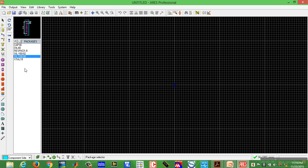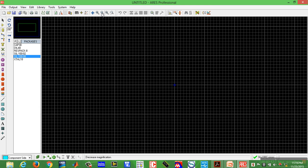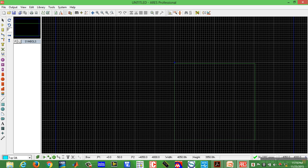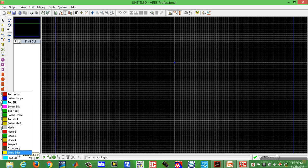All the components are here. Now adjust the size and shape of the PCB board using the 2D graphics box mode. The center mark indicates the 0,0 coordinate. Adjust the screen window — I am selecting a 4 by 4 inch square PCB board. The screen is divided into 1 by 1 inch square blocks. Click on it and select the 4 by 4 square PCB block with the board edge.